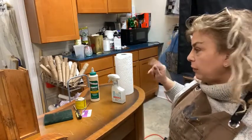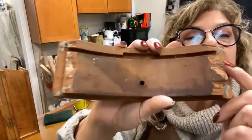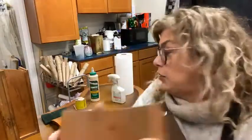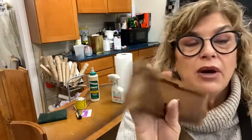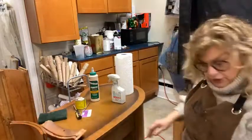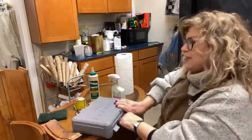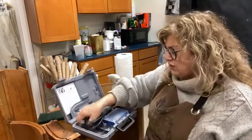If you want a good quality finish, you have to do the good quality work. Now, if you look at these drawers, they were glued more than once — you can tell some of this has been broken and jagged up. This one had seems to have come off without many problems, but this other one — I've got to take a Dremel and clean all that cruddy glue off. I'm not using sandpaper or a sanding block because I can't get down in here with that.